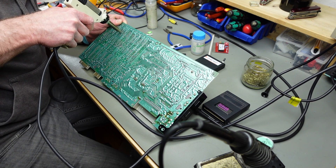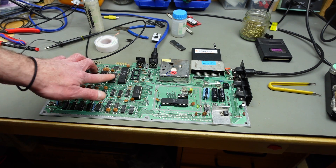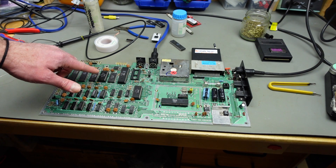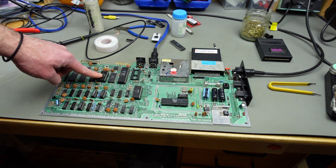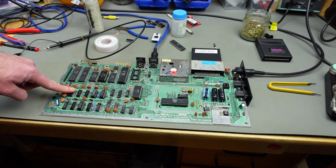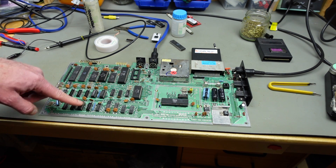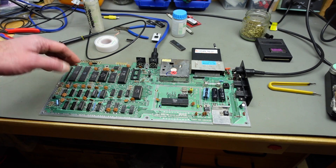Maybe it's just some broken RAM. I'm going to go in and replace all the RAM. I also want to look at the ROMs because that's where the data lines go too — at least the basic ROM. The kernel ROM I replaced with a known good one. The wonky signal was even present when there was no chip in the socket at all, so maybe it's another RAM issue — at this point no idea why the address lines look so strange with broken RAM alone.